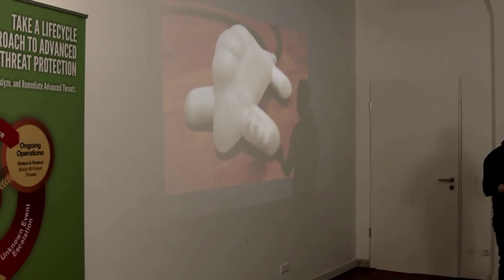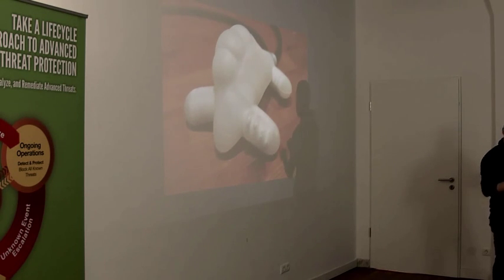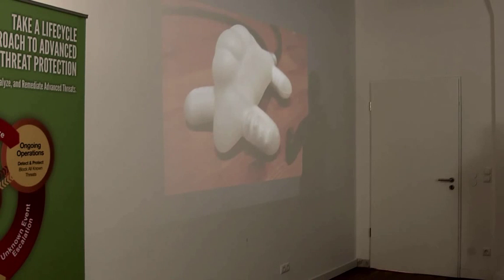The idea is that you don't have a series of hard mechanisms that each have a known bend radius and a known amount of force, but you try and link up all of the systems together to create something — usually using soft materials like rubber, often using flexures or plastic components that are meant to bend in tandem — so you actually have a total system mechanism where you do complex body calculation. It's often more efficient to prototype an idea via 3D printing than to do complex multi-body stretching, twisting, and inflation calculations in simulations like MATLAB.